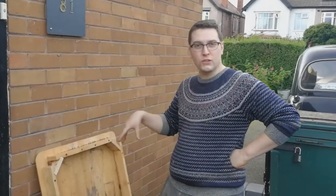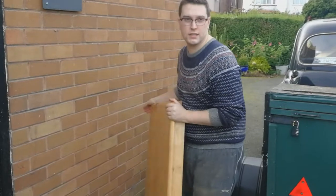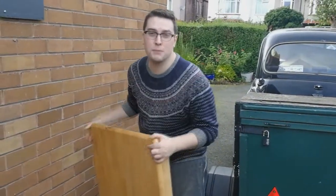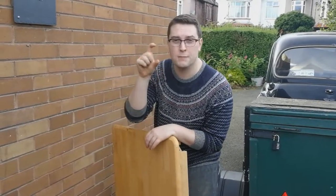I've been and had a look in my stash and found this old oak dining table — someone gave me it for free. It's got a big crack in the bottom so it's not really worth anything anymore as a table. I'm going to cut this up into strips which are the width of the studding plus the chipboard plus the height of the parquet, then cut them into strips and do 45-degree angles on each strip and then attach them.